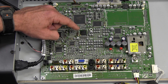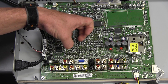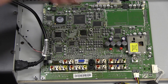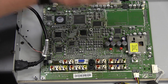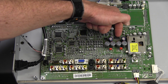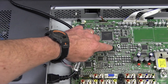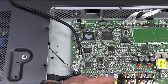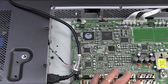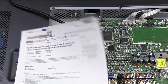A few people commented that this one looked like it may have been burnt out, so we'll take a closer look under the x10 macro lens. It's warm so it's powered up. It's getting warmer and warmer. I don't know if that's normal for that device — we'll have to check the datasheet. And oh, that one's pretty hot! We'll have to check what that one is. So let's take a close-up look. As I noted in the previous video, it seems to be the decoder for all of the analog inputs — the component, the S-video, the RGB — because all of these AC coupling caps are down here and you can see all the traces flow from there into there.